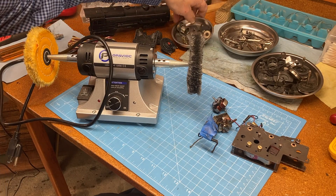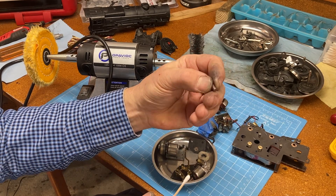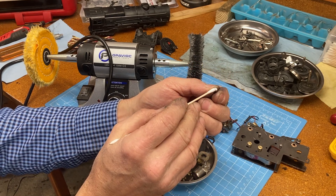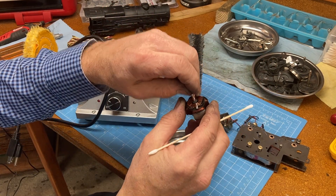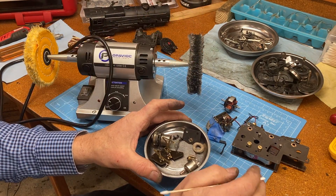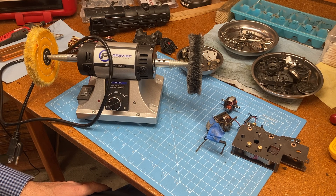The electrical parts are all clean. In addition to the commutator bars, these are the brushes — I've taken the wire wheel to these and then I put them in the lathe and polished the surface that runs against the commutator bar. It's going to make excellent smooth contact there. I really think this is going to run very nicely when we get it back together. I'm going to go off camera and do my soldering, and when we come back it'll be time for reassembly.